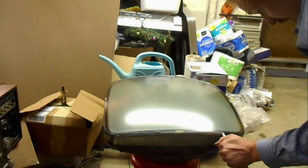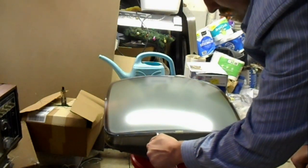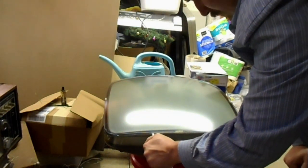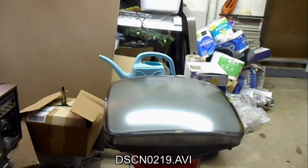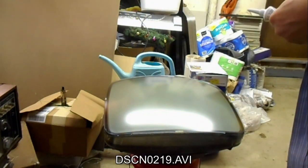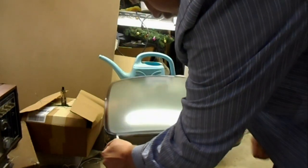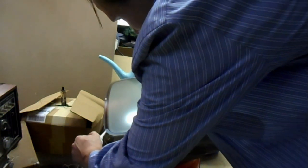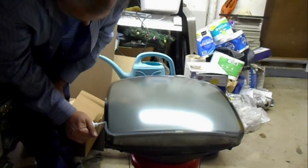But these style CRTs where the safety glass was bonded to the face of the CRT with transparent PVA glue were only prevalent in new televisions for approximately a decade, from the early 60s to the early 70s. This was originally introduced on round screen color CRTs in the early 60s, probably somewhere between 61 and 63, I'd like to say. The CRT that used this was the 21FJP22 and a few others.